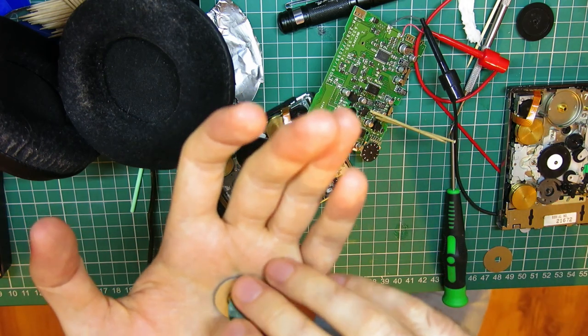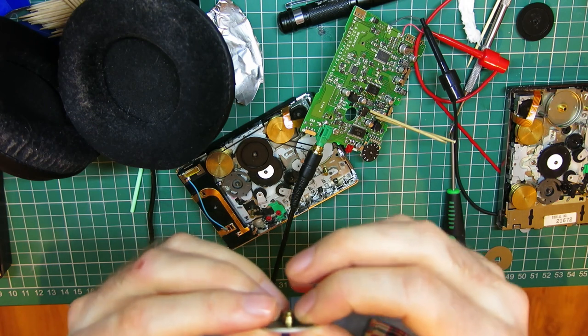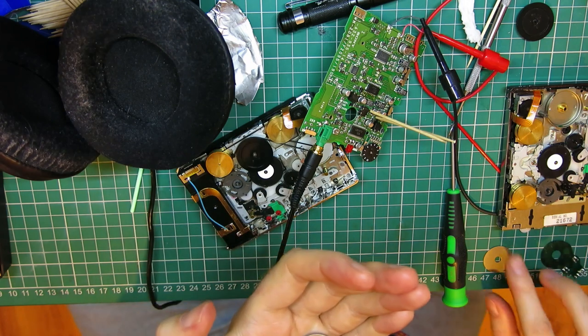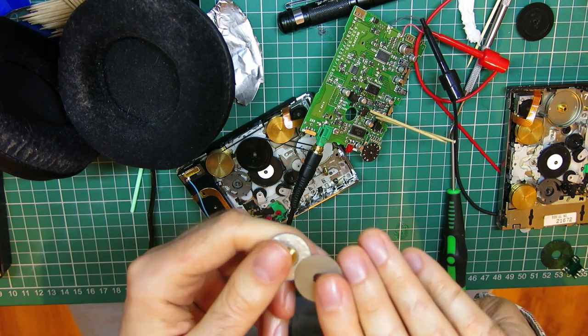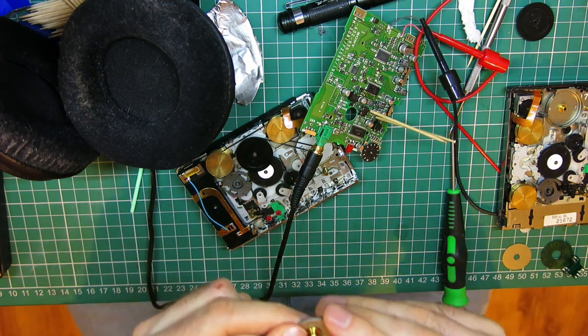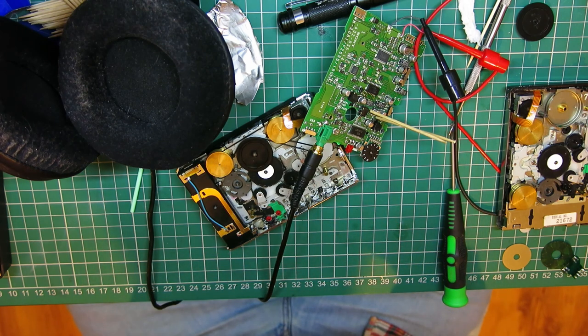And the tolerances in these are so slight. They have to be very, very close together, and they have to kind of float, which is why, you see, you've got this. It's a really strong magnet as well. It's probably neodymium. This top piece binds it together. So I'm going to guess exactly the same thing is happening to this one, which is why we've got high current draw and grinding noise and friction on the motor.